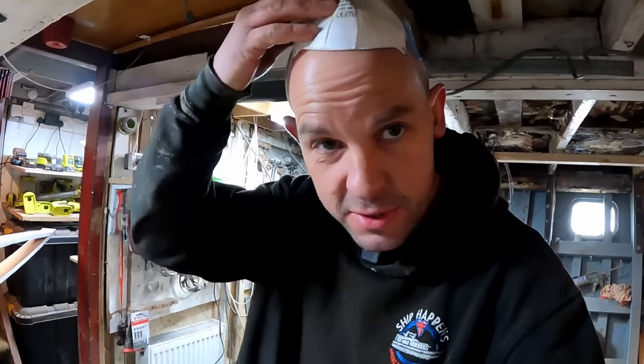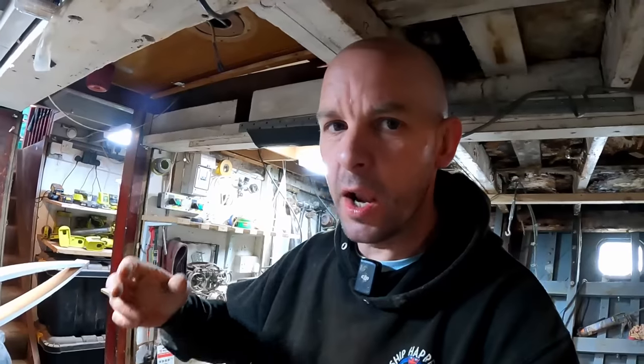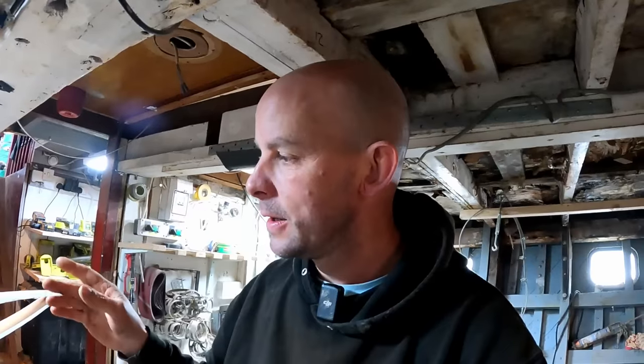So I've just spoken to West System, look like I've got a stupid hat on, and basically, because it's such a massive curve and we're using oak, oak has loads of energy. Oak just wants to strain itself out, doesn't care, it wants to continue its life on how it grew in the tree, it wants to stay straight. We've curved it, put it all together, we then take it off. We then leave it a while, because then we paint it, it slowly straightens itself out. There's massive tension going on. And I start cutting it, putting it in the vise, knocking it, doing whatever, sanding it. And he goes, okay.